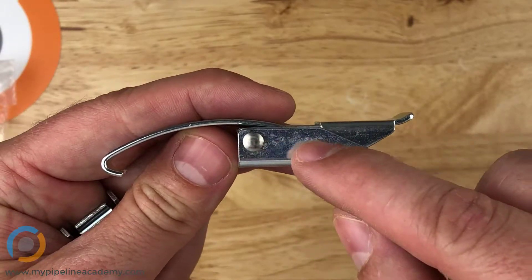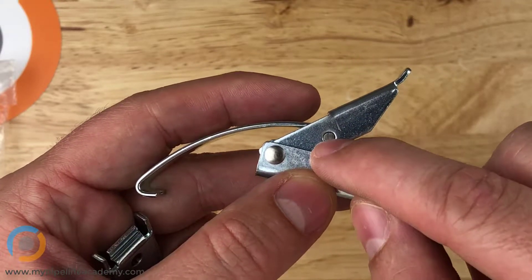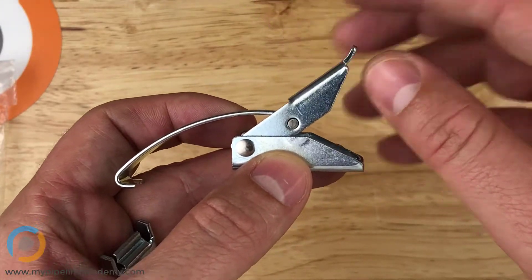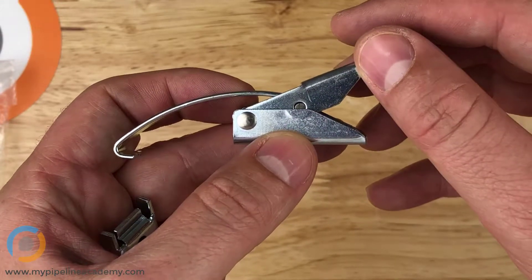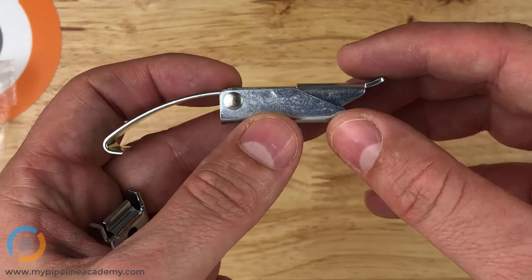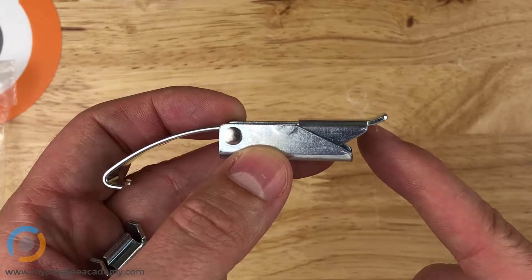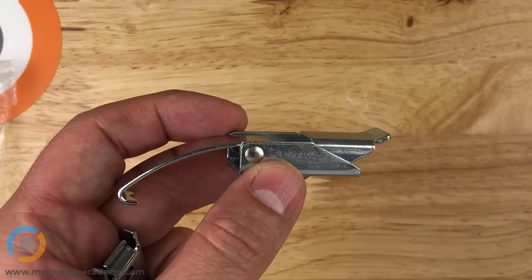That's important because this is what keeps the latch closed. If this pin only ever ended up right at center when the handle was closed, the whole thing would just spring back open. But we're going past center — center being the pivot pin — and this pin drops down past center. It's about at center right there, and then it moves a little bit more, and now it's past center. That's what keeps this handle closed and prevents it from springing back open. It's going to require a little force — maybe a pound or two — for the user to push this handle back open and release the latch. And that's how a draw latch works.